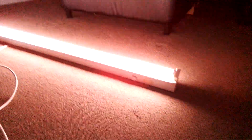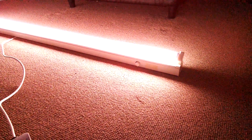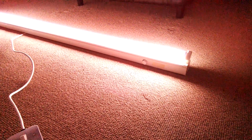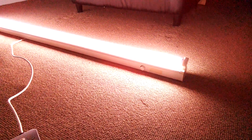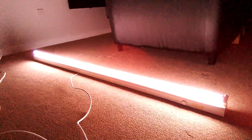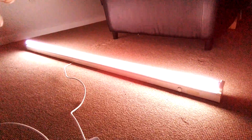I've actually changed the starter in it because it says 100 watt to 125 watt, which usually mentions 75 watt to 85 watt — that's usually fitted into a six-foot strip light. But this one is made to be fitted in an eight-foot strip light, though they are made for six-foot as well. As you can see, the strip light has fully come on and the very middle part is quite dark.